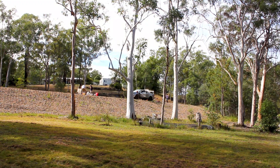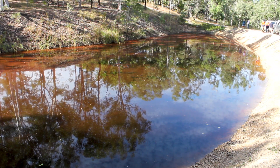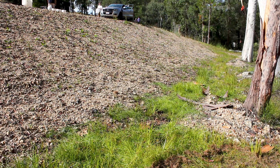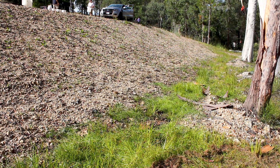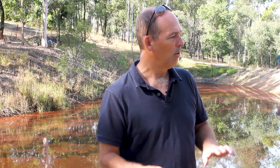We've got a situation today where the landowner has actually stripped some trees out. The tree roots were tracking right down into the dam itself and basically a deep trench has been cut right through the middle of the dam wall here. All of the tree roots have been ripped out and it's been reinstated with a large excavator, but the problem in doing that is it's actually broken the seal.